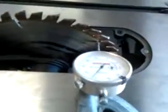And it's up here, there it is. And one thing I did find out is they say to loosen these bolts here 1.5 turns, and then just give it a light tap with your dead blow. That does not work very good. There's a lot of play in this, and one thing I did do is I loosened it up and just grabbed the motor and picked up on it. Even now, you can see it moves just a little bit. A little bit of play in there.